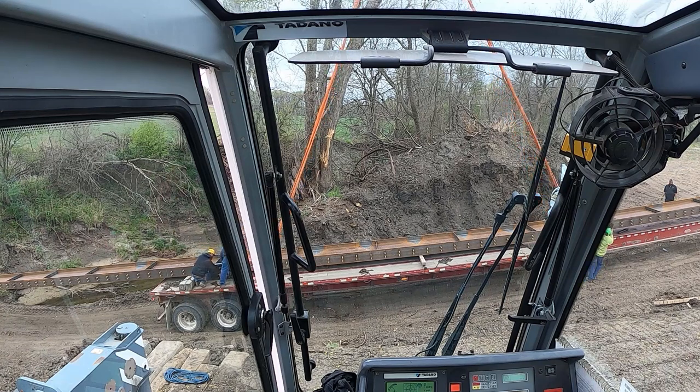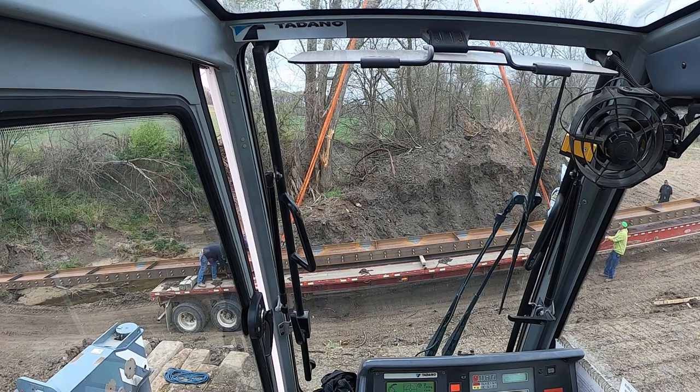We're rigged up the way the crane's configured. We've got full span outriggers sitting on our big mats with full counterweights, all 110,000 pounds hanging on the back. And right now they are putting 1¼-inch steel chokers around this beam, choked with shackles.